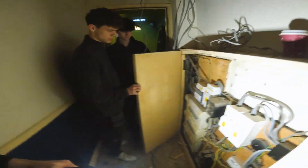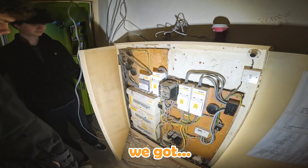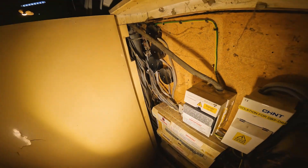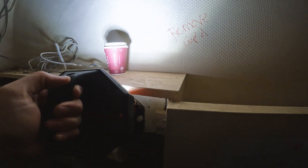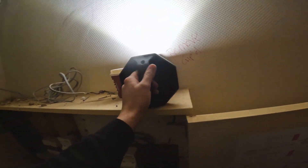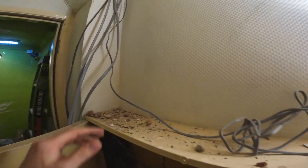Alright, we're in. So this is what we're gonna deal with. It's a mess, isn't it? Look at all this - all them bundles of joy in there. So what we're gonna have to do is put another fuse board in which will cover all this section. We can show you the plans later - show you what we're gonna refeed. This is all coming out of this boxing section, so we're gonna smash all this out and then that'll give us a bit of access above. We want to get some containment in there somehow.